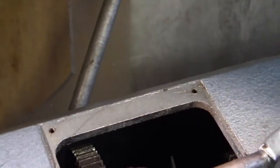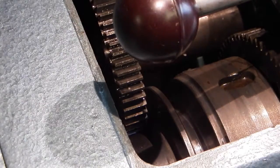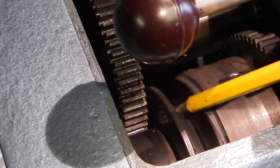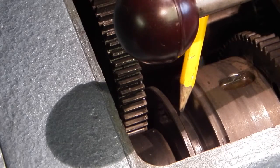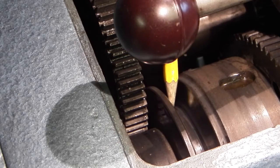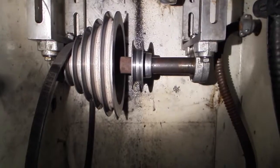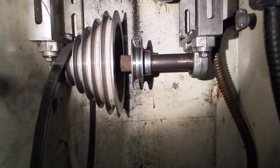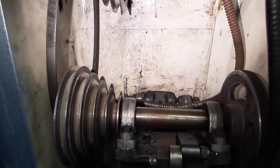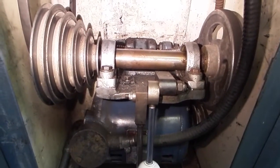You can see the condition of the pulley — this is the V groove for the belt — and it looks as if the pulley has been just touching the bottom of the V. That means even if I took some links out to tighten it further, once it's touching the bottom it loses traction on the sides of the V. Let's check the bottom pulley. You can see the bottom pulley which I've cleaned. The pulleys on the left are to select the speed; the right-hand pulley is the drive to the motor and the left-hand pulley is for your different speeds.